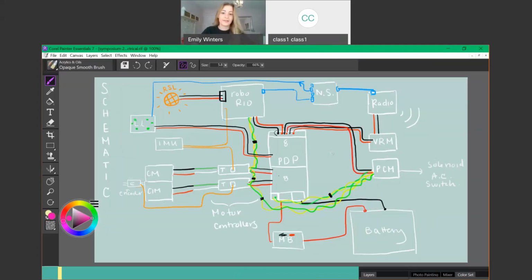But if you have wires that have to go around the entire robot, that's really when wire management is a huge problem, because you have to make sure they're out of the way of any moving objects. The way I found most suitable for wire management is the smallest zip ties that they make. And then definitely plan out where everything's going beforehand and try to make your connectors on your wire so that there's not a ton of extra wire available.